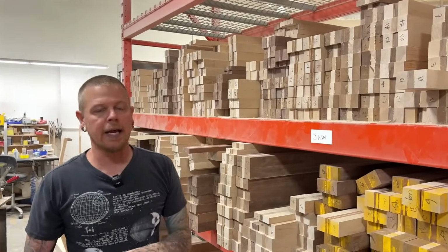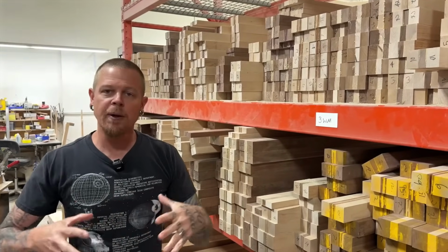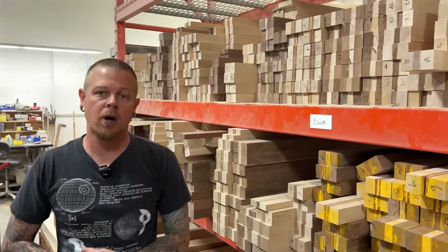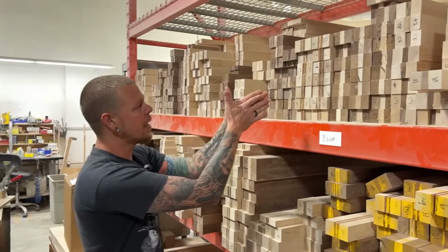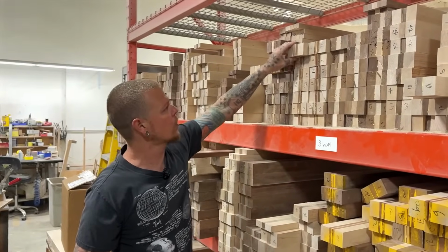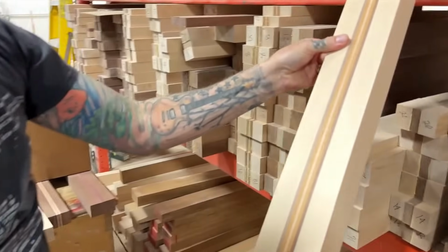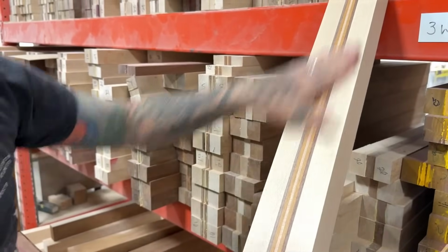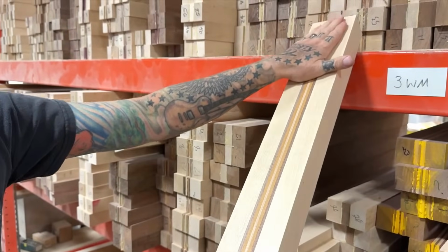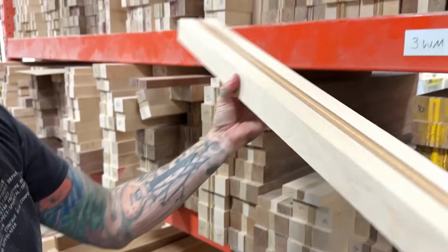And then we're going to thermal treat all of the necks. So we are going to put them through a secondary kiln drying process. So the wood is pre-dried, and then when we glue them together, we add a little bit of moisture, right? The actual glue itself is going to add some moisture when we laminate them together. And then we're going to put them through a process after we machine the top and get everything perfectly smooth and perfectly flat.